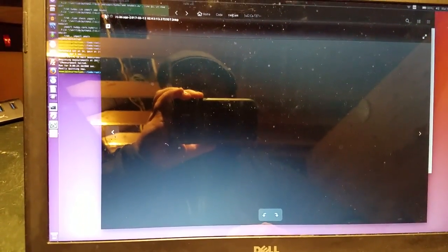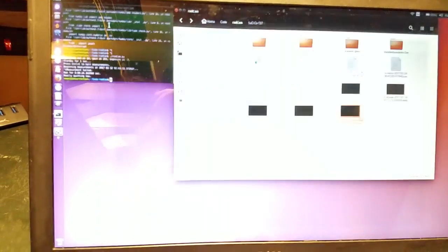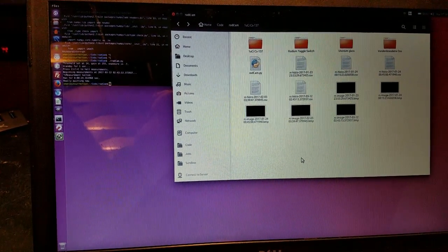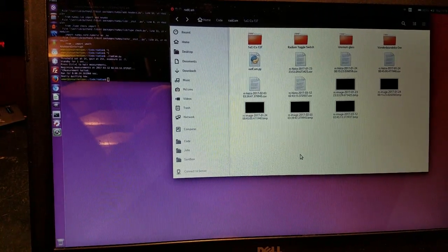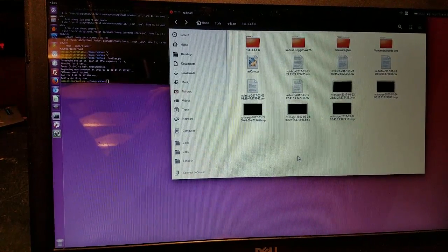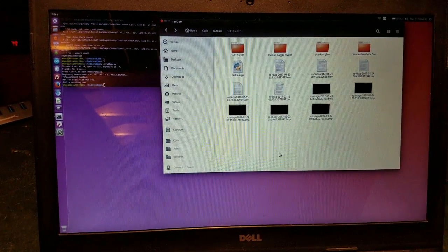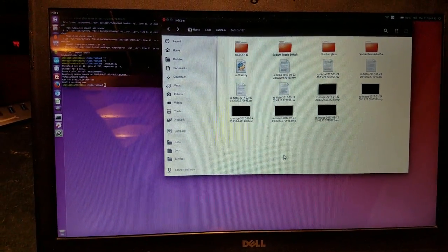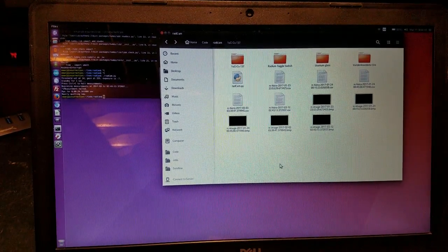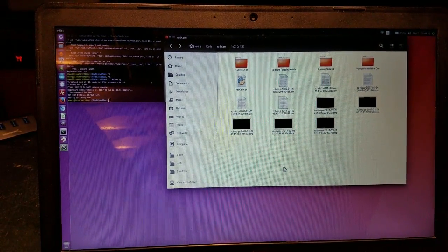But anyway, yeah, so this is a demo of how a CCD detector could be used. I'd also like to see if I can take it to a calibration facility and see if I can use it as a dosimeter as well. To see the amount of radiation over time that it gets, if I can correlate that with a dose. So if I know that I'm exposing it to 10 microsieverts per hour of cesium-137, and then 20 microsieverts per hour, if I can correlate the amount of activity in the file with those dose rates.